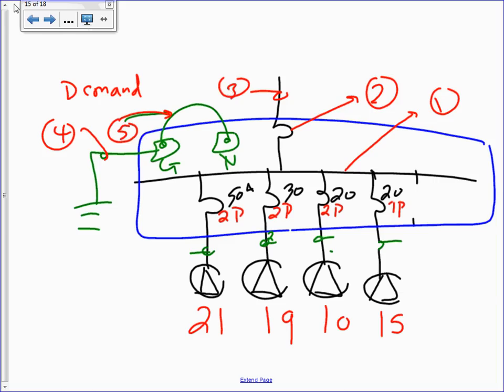Before that, I'd like to add a couple of things to your picture, guys. If you have a 20 amp single pole circuit breaker, what do you think the cable going to a 20 amp receptacle would be? It's a single pole. How many conductors? With a ground, two conductors and a ground, so three conductors. Typically, unless it's too long, it will be number what? 20 amps goes with number 12 AWG. These are just sizing for the amps. Piece of cake. Let's go back to here.